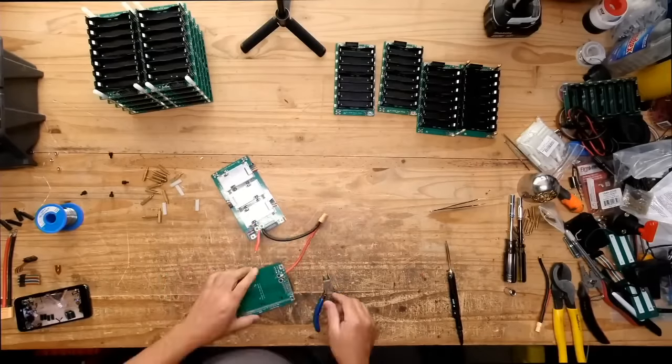So of course it's only seven boards per side, right? So it will only handle, what is it, 2.5 times 7? Whatever that is, that's the amount of amps. So it's about a 1 kilowatt hour battery pack in it. So you can get continuous about 1,000 watts. You can do bursts of more, up to 2 kilowatts, but after that, the fuses will start blowing.